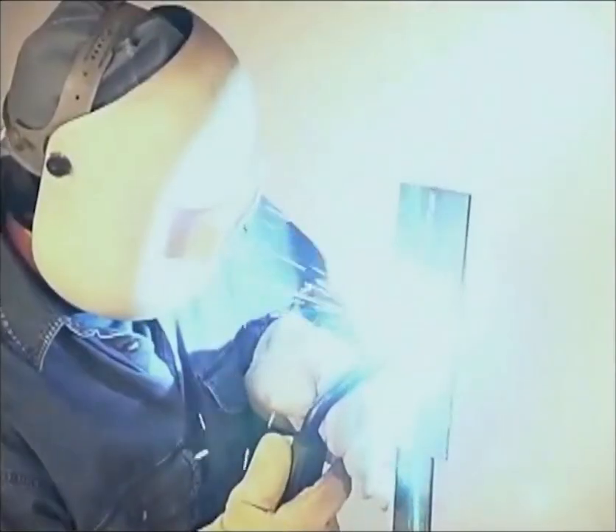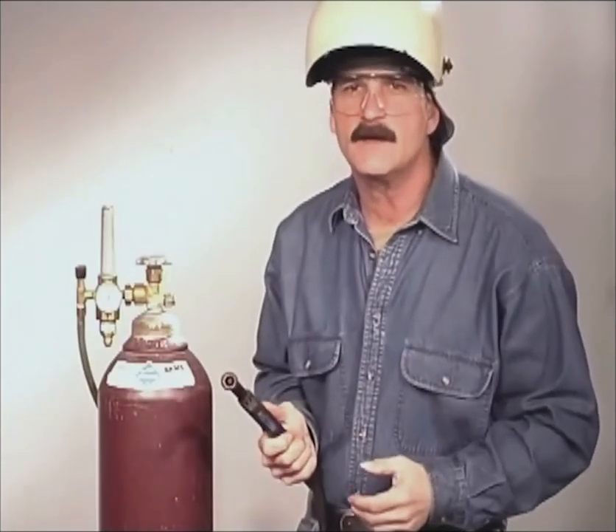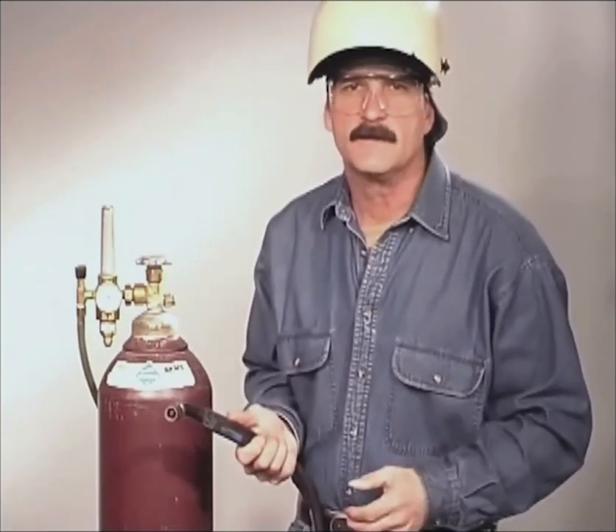This is industrial equipment, and even the smaller welding machines are well built, but part of wire feed welding is keeping the wire feeding smoothly. While you are welding, little bits of hot metal called weld spatter fly out of the molten puddle. Regularly check the nozzle and clean out any buildup of that weld spatter. There are anti-spatter products available, either a dip or a spray. These don't stop the spatter, just help to keep it from sticking.